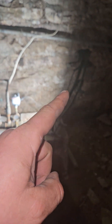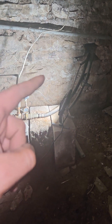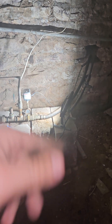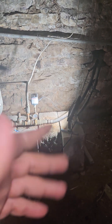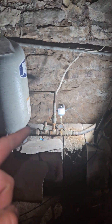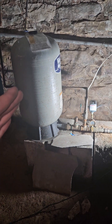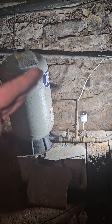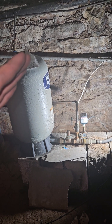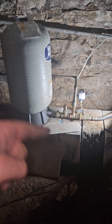Another thing: this system is waterlogged. So even when you fix the outside — when you pull the pump, replace everything in there, drop it back down, replace the check valve and foot valve — without that working, when he runs water you'll notice the bladder tank is bad because it goes on, off, on, off. It doesn't build pressure, hold pressure, and come down slowly.